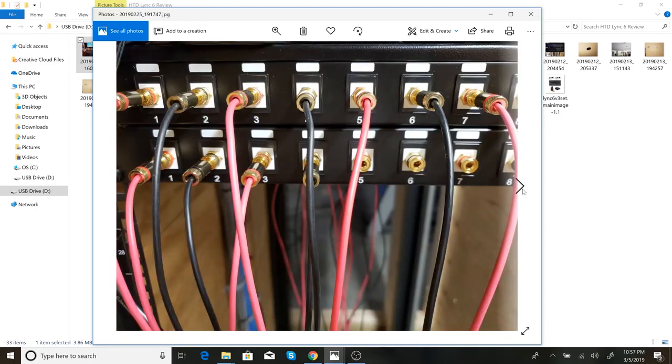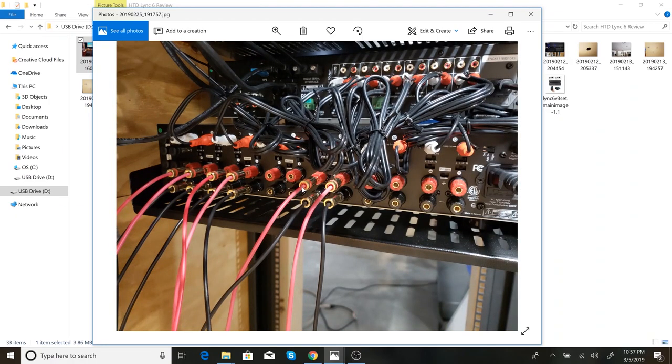Here are the banana cables I made myself. These are banana plugs — I'll have links to this stuff on my blog site. The wire that ran to the speaker locations is 14-gauge; I'd recommend running 14-gauge if you can, especially over long distances, as it gives you extra conductors you can pair up if needed. But these short cables are 12-gauge model wire — I just pulled the jacket off and made my own cables. Here's the amp side — you can see how much easier it is to just plug those banana connectors in than it is to try to get individual wire strands up in there and screwed down under those terminals.